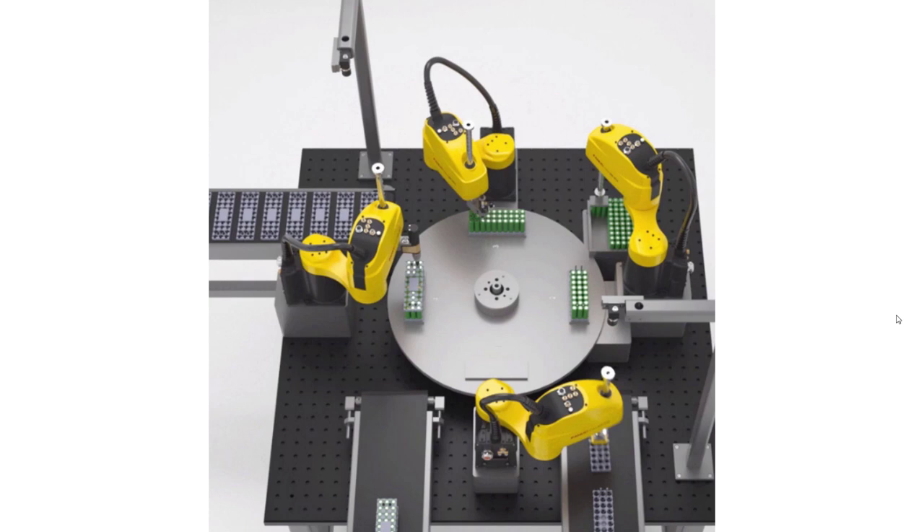The fourth robot also picks up the finished battery and sets it on the takeaway conveyor at the bottom left. So: plastic cases come in on the bottom right, more plastic comes in upper left, batteries are in a tray upper right. This is kind of what this project is doing — except it's not batteries, and the robots have grippers. The end-of-arm tooling (EOAT) for all three robots will have grippers. One of them has two grippers so it picks up two different things. Actually two of them have double grippers, so we actually have five end-of-arm tooling configurations across three robots.